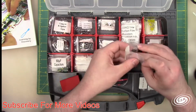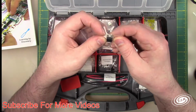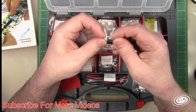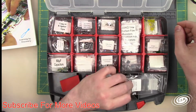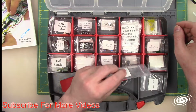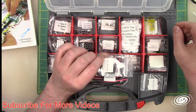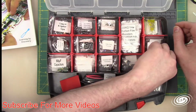We have a voltage regulator. Let's see if we can pull a number off of that. This is an L7805, so it's a 5-volt voltage regulator. We have some diodes here, 1N4148 diodes and 1N4001 diodes. These are Zener diodes here. They can be reverse biased.